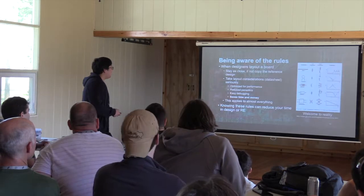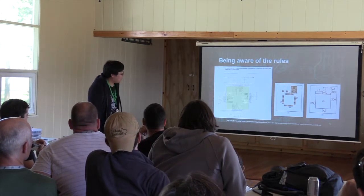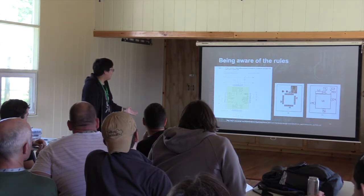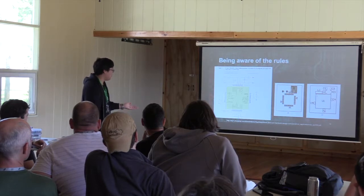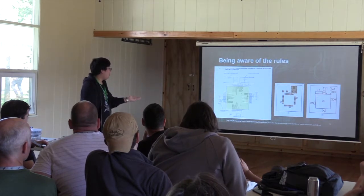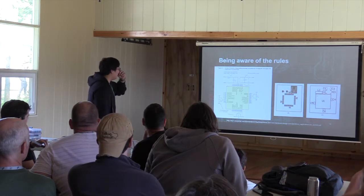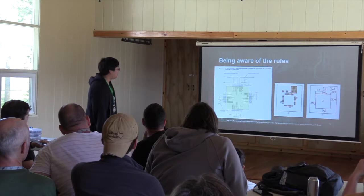Yeah, and the biggest help for anything in hardware design is layout rules and layout reference designs. As hardware reverse engineers, this is also very useful, because typically you'll see that the part will actually exactly match some of these layouts, as I've found. It's because design engineers don't want to take all the risks.